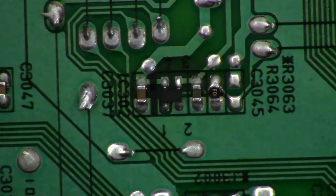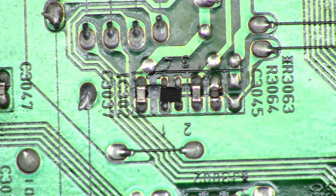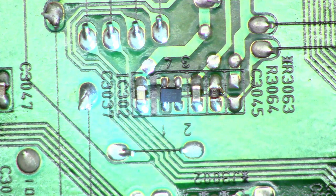Next I need to make sure the replacement IC is oriented correctly. I'll shut some lights off to see the markings — I'm looking for a white stripe on the left-hand side next to pin 1, and I do see it right there. It is oriented correctly, so let's throw this back together and see if we get 3.3 volts.